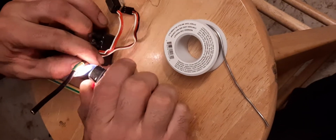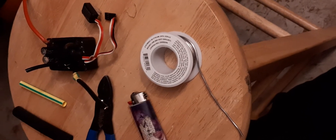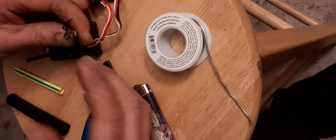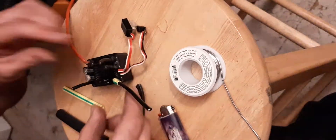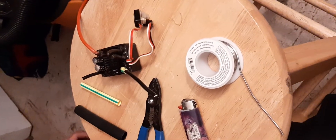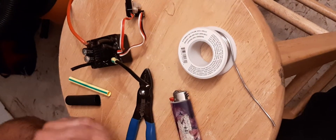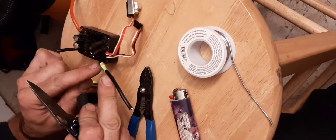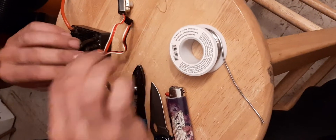It's not going to be something you've got to tear apart. It's not going to get hot and melt and come apart, as long as you make sure that solder is flowed all the way around. After you're done with that, you're going to take all three wires that you've put your extensions on — because obviously you're doing this because of a short wire, or something got caught in a gear, or maybe you've cut them back so many times reusing the motor. Then I take a section of larger tubing — the shrink tubing — and I usually give myself enough room to cover my repair by a quarter inch on each side. So if I have three quarters of an inch of tube, I want an inch and a quarter of big tube to go over top of both small tubes on each individual wire.